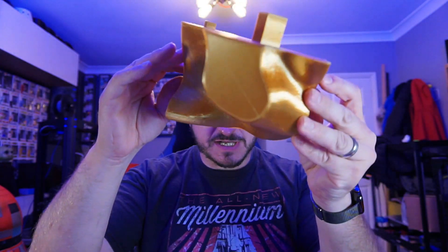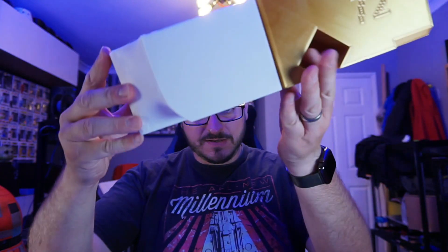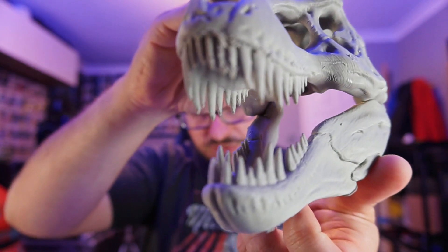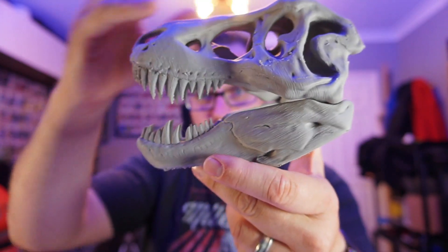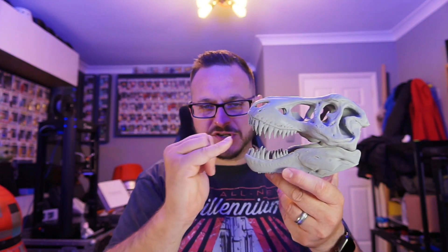The print quality has been good overall, though the printing has had some mixed results. I've had some really, really good prints come out of this — even at printing at the maximum of 150mm per second, and it's not printing at that all of the time, the results have been pretty good and the printer has been very quick. We moved on to different types of filament — this is a PETG that came out really, really nicely, although we started to see a little bit of stringing with that. Let me show you something more intricate — this is a T-Rex head. As you can see on the teeth and some of the smaller parts, running at those kinds of speeds it does start to struggle. While I was printing this we did have some overextrusion, which is basically where I'm recording on OctoPrint as the print head moves to take the photo, giving a little bit of stringing. So some retraction settings and dedication to dialing things in would be a must.